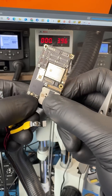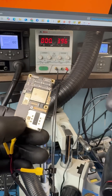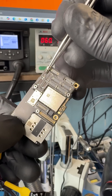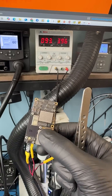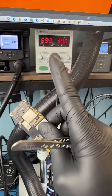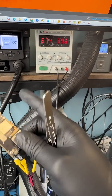Let's plug in a good working motherboard and analyze how the numbers should look — we can tell a lot from how these numbers climb. We short the power button pins to turn it on and watch it climb to 130 milliamps, then slowly up to 1 amp. This means the board is fully powering on, and this is the first step to diagnosing any iPhone motherboard.